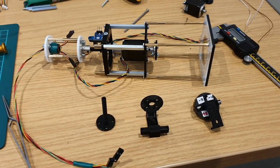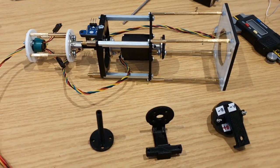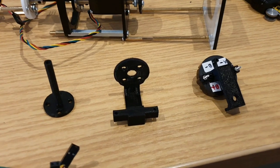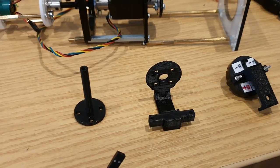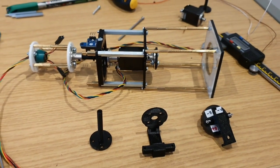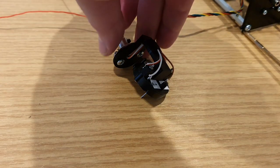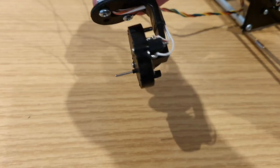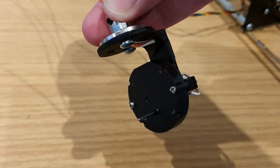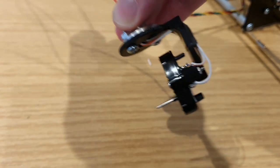And again, we've got quite a few of the 3D parts to print here. These are the ones with a couple of very small revisions for holding in place the X27 style stepper and also the mounting of the trigger arm for the optical sensor. It's worth taking a close look now at the stepper and how it's mounted. This is for the pitch axis, because this really is quite a key part for suspending in place the attitude cylinder.